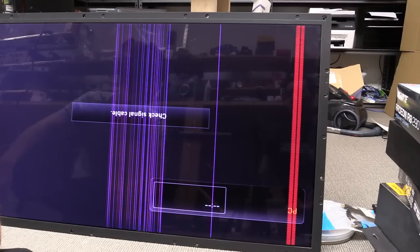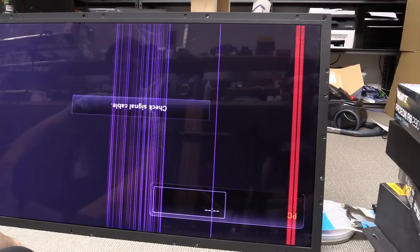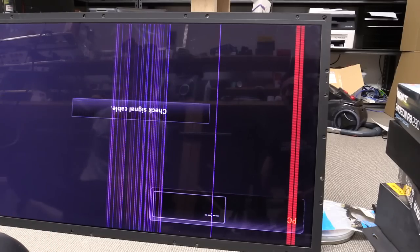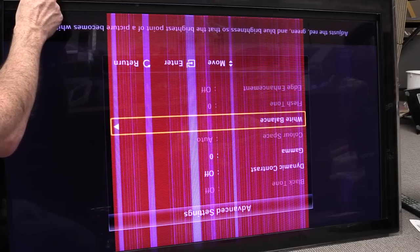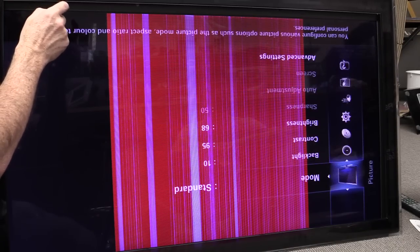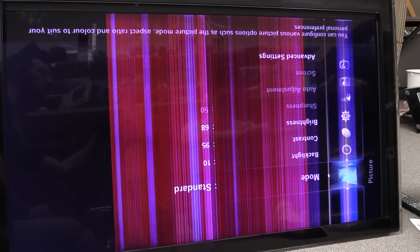So maybe it's almost as if the density of the character is causing a vertical stripe issue — it's just bizarre. We don't get anything on these vertical lines here which are solid bars, so it's like it only happens on the text insertion side of things. Plus we've still got the issue with the horizontal lines, but that may or may not be related — there could be two separate faults. One of them seems to be definitely related to ASCII characters.